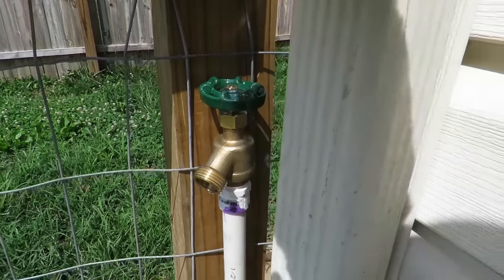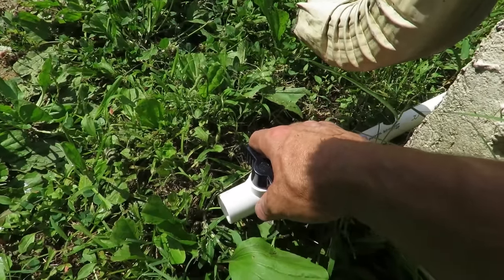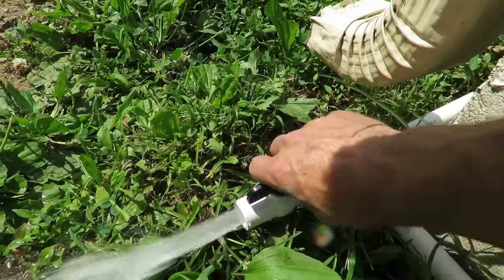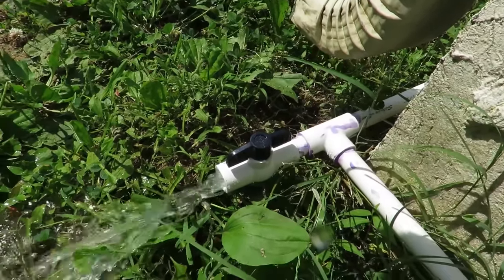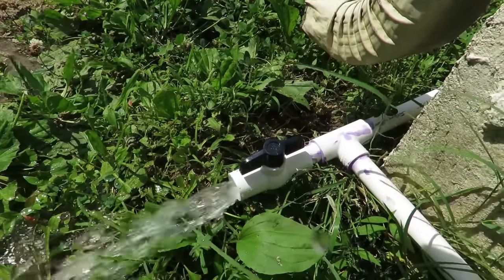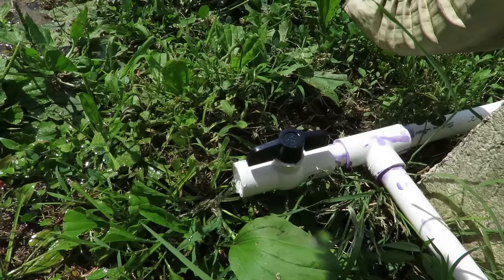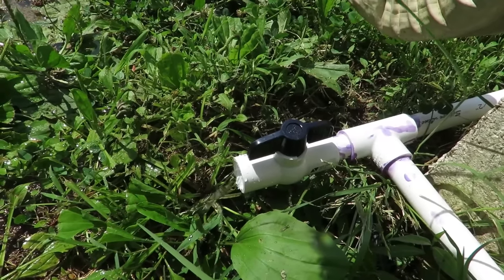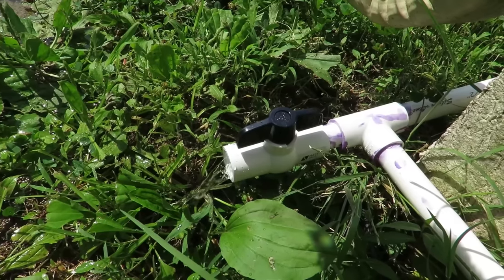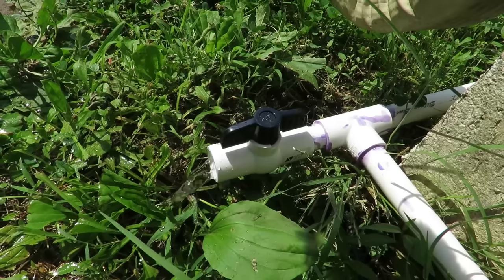Let's go ahead and check out that drain. You don't have to put this drain in, but I did it at this point because if I ever wanted to drain out the lines for winter time, I don't have a hard time. And here we go — you can see that it's actually working. It's at the lowest point of the whole entire system. So now that the water's been turned off, you can see that everything else is just piddling out of there. It's not going to gush out like it was before because it's not actually on — we're just running all the extra water out.